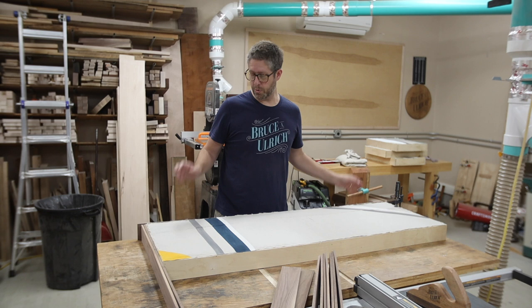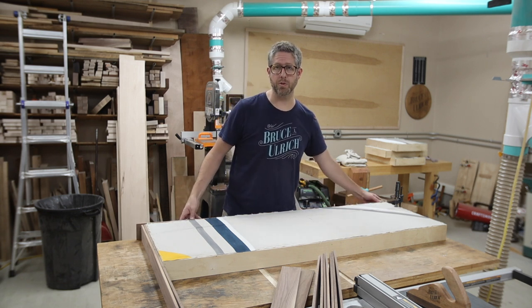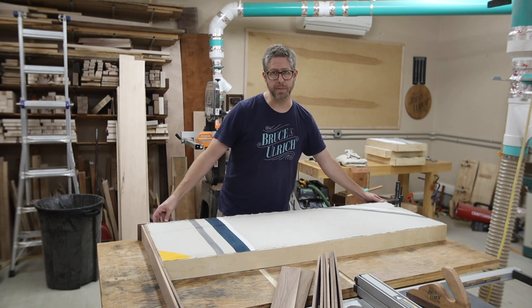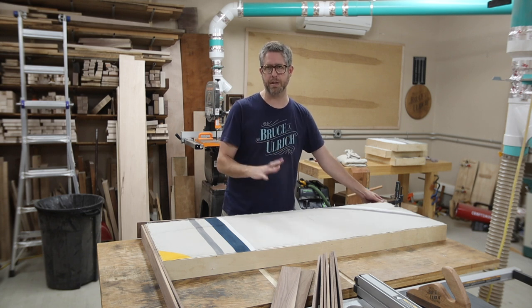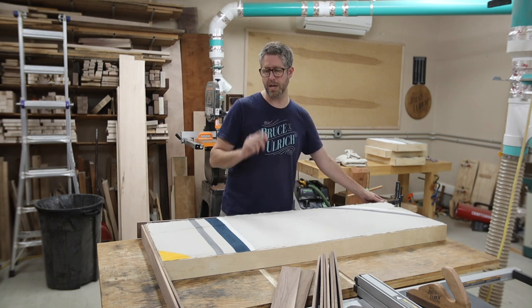The time has come to put the walnut frame on these pieces, and I'm just going to reference the actual size of the pieces and then cut them to length. It's a very accurate way when you have multiple different sizes. Rather than trying to nail all of your measurements from a tape measure, you can use the actual piece. So briefly, here's how you do that.